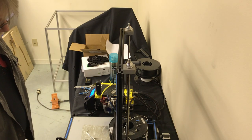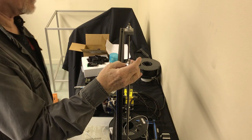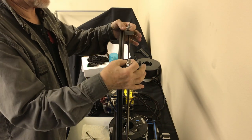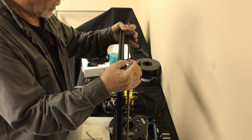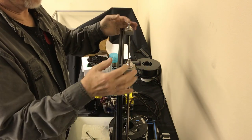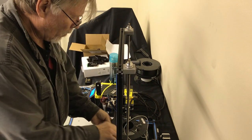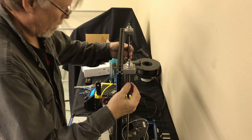Okay. This is where it's important to level it, because once we hook the belt to it, you're locking these two together. You will have no drift when you shut your machine off. It may go up or down, but both of them will go up and down at exactly the same point. So, I'm going to...